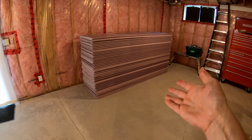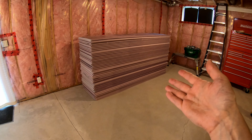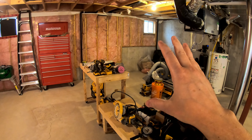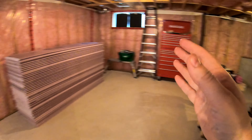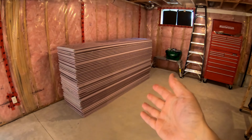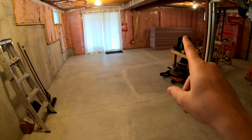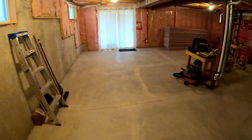As I mentioned earlier, I do have all the foam board here. The plan is to get that glued to all the foundation all the way around so that I have a nice thermal break, and then I can get started on framing, which will come pretty much immediately after I do the foam board. I can start framing in the outside walls all along there. So that's it for the update today — I'll do another one once I've got all the foam board up and most of the framing done. If you're interested in seeing that, make sure you subscribe. If you have any questions, let me know in the comments below. Thanks for watching.